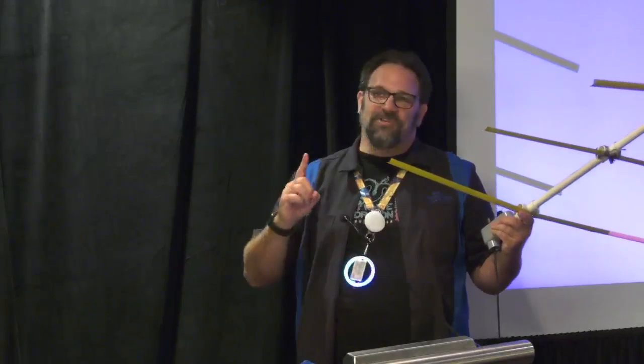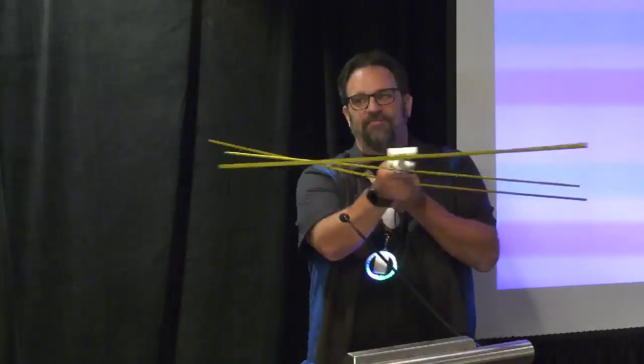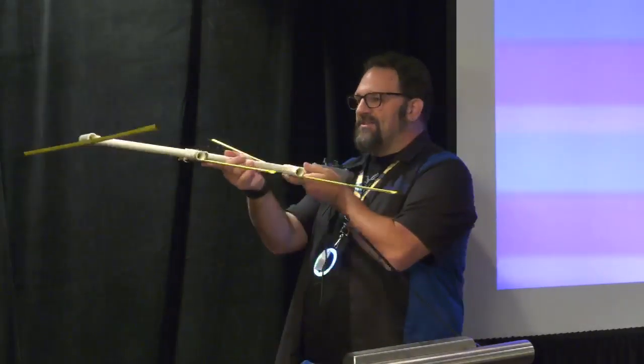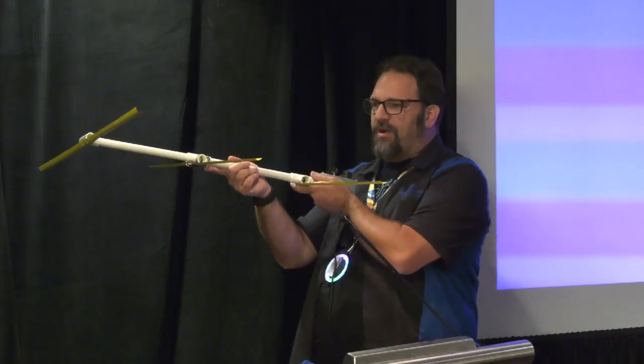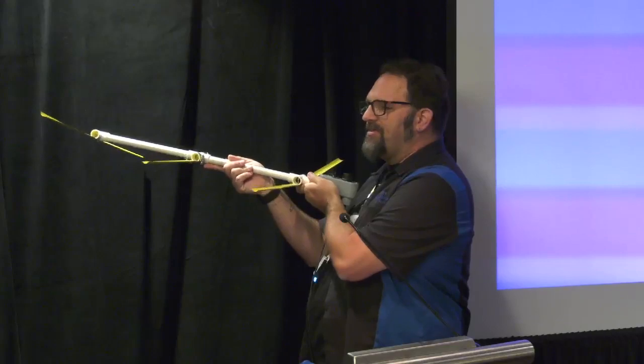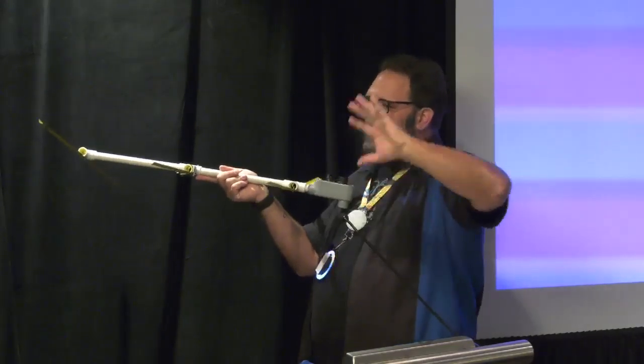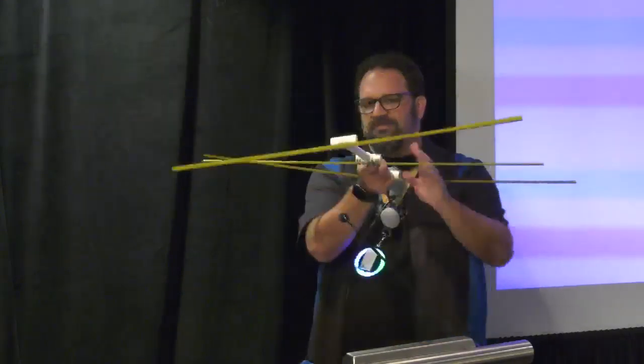Oftentimes, you actually want to listen to where the signal is the weakest. Because it's strong, strong, strong, full quieting, full quieting, full quieting, and it's not until I get to here that it comes away from full quieting. And I can go, all right, where is it the weakest? It's right about there. So I know that that's the side. So sometimes you want to listen for the nulls. Sometimes you want to listen for the strongest signal.